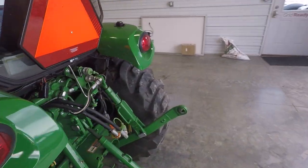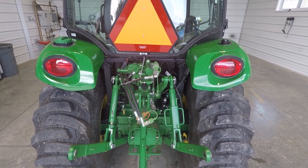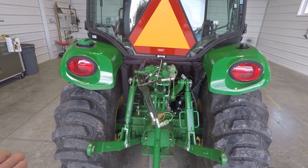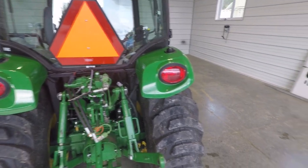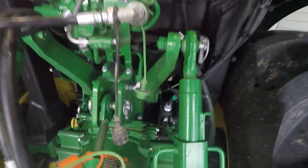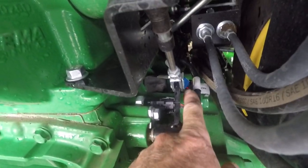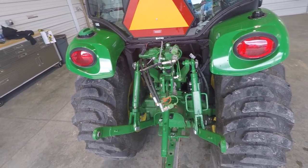The other safety feature is that John Deere has a mechanism where when the cutting deck is operating and you go in reverse, it kills the machine — that's about the dumbest feature there is. I disabled that as well. Basically you're cutting grass, going around a tree, you want to back up and continue cutting or realign yourself, and the machine kills itself — you have to constantly turn off the PTO switch, which is the yellow button there. I found a video on the internet that tells you how to configure these sensors down here to bypass that safety mechanism. As of now the tractor does operate with its mid-PTO in both forward and reverse.